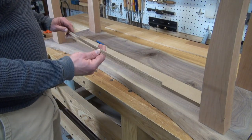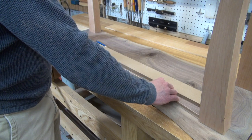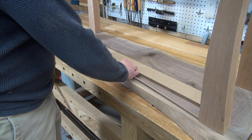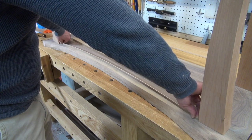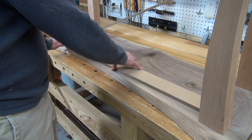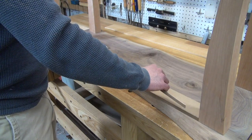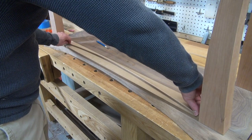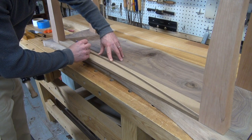My next step is determining just the right curve to put on that to match the profile of the table top. Once again, I'm going to use a thin strip of wood to help me set the right curve for this profile. I've cut this piece — it's a thin piece of white oak — and I've cut it so that at the exact length it is, it forces the right curvature to match the grain on this piece, if I can get the ends to stay put. To transfer that curve, I also have a piece of MDF that I'm going to use as my template. I'll flush it up with the front of each leg, then put my strip so that I have an eighth of an inch reveal on each end, and then I can scribe that with my pencil to give me my curve.